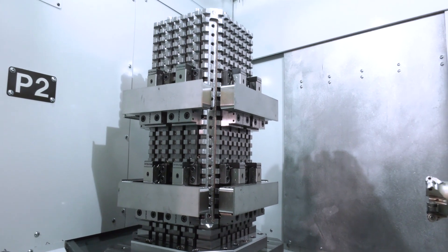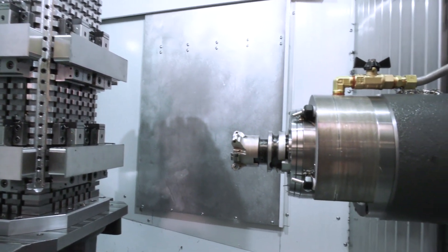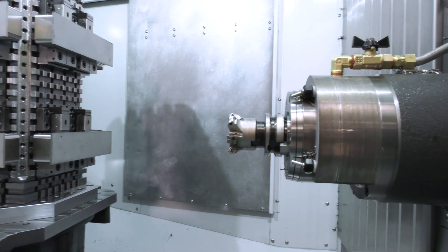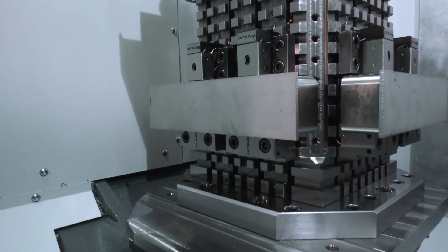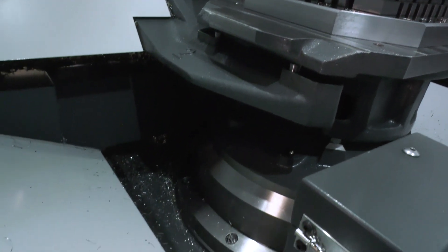As you can see, it's stainless steel — all our work is 316 stainless steel. We can take big cuts, but it's also about getting that swarf out. There's a massive conveyor on this machine so we can drag the swarf out as quick as we can cut it.